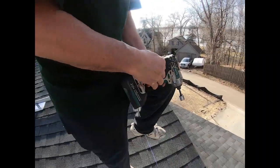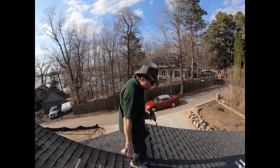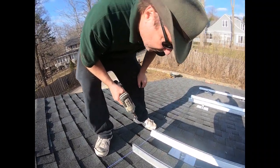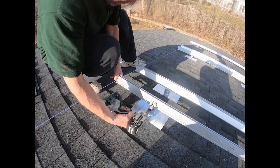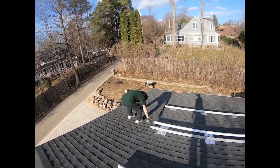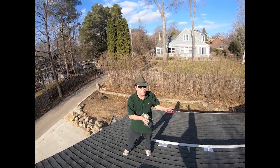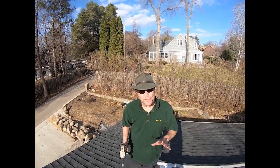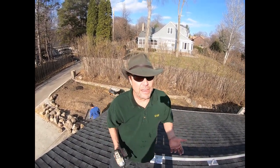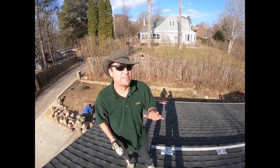I watched until this started coming up — once it stopped coming up I knew I was level. You can see this one looks good but down here we've got a gap, that one is high, and those look pretty decent too. I'll just raise this one up a little bit. I've got it level on one end and I'm going to work my way across and get the whole thing leveled out. The key thing is that roofs aren't always flat, so you've got to accommodate and work your rails up and down to get them level. More importantly, you want your rails level so when you get your modules on, they look nice and straight from the ground.